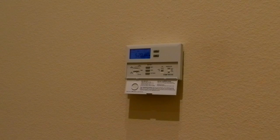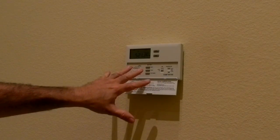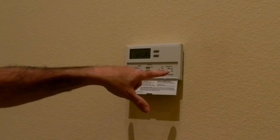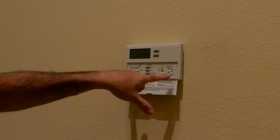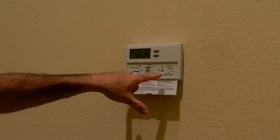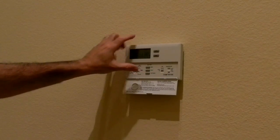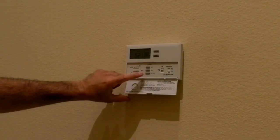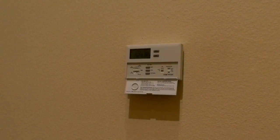So, all right, this is incredible. I'm very happy. The installation was very easy. It took a long time because I was doing the video. If I wasn't doing the video, I could have cranked this out in a short amount of time. No hassle at all. You saw all I did was take off the old unit. I marked the wires. I made sure they didn't fall back in the wall. I took the drill, put two holes in there, put the anchors in the wall, mounted the back plate with the two screws, and then connected the wires onto the proper screws, snapped the front piece back in there. I put some batteries in, of course, put the front piece back on and just adjusted these switches, and it was a very easy installation.